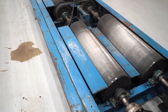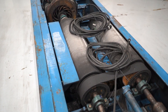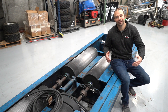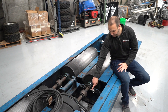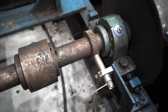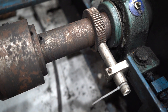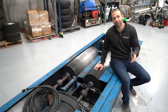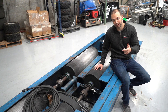We're on the back roll set now. Both the front and back roll sets have speed sensors on this dyno because the front and back rollers aren't connected — that's unusual. This back roll set has a speed sensor located right here. Here are the teeth, similar to a crank trigger ignition system — you have teeth and a pickup, and as the teeth go past the pickup, the speed of the roll set is counted. This is important because it measures the speed of the dyno. Remember, we need to know speed and force to measure horsepower.